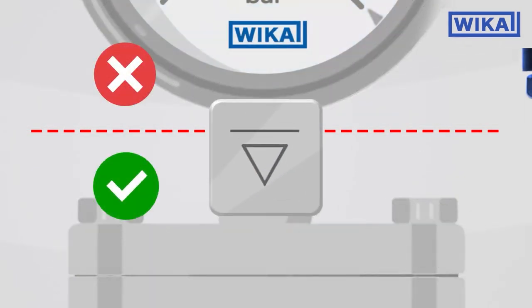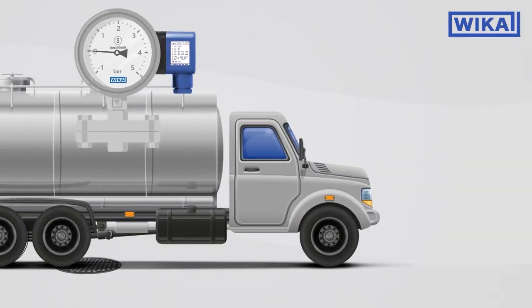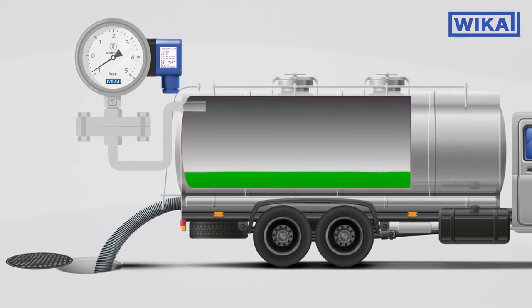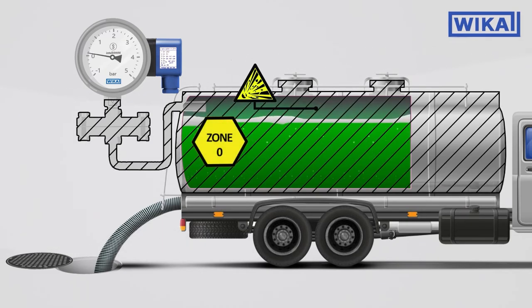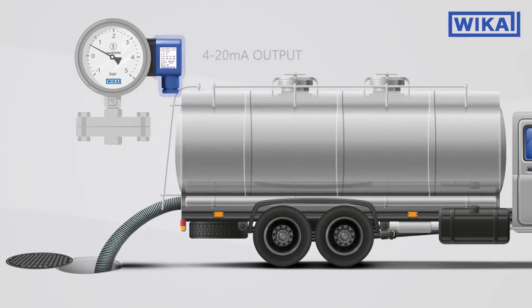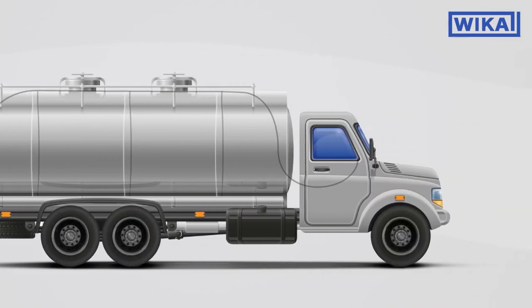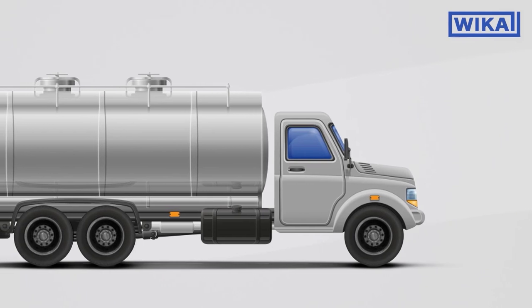The position symbol marks the zone separation. In wastewater transportation, the PGT-23 pressure gauge with flame arrester is mounted on the tankers of vacuum trucks. Wastewater can sometimes produce flammable vapors and corresponds to a zone zero hazard level. The 4-20 milliamp output allows the gauge to send its value directly to the truck driver, who can have full control of his vehicle directly from his cabin.